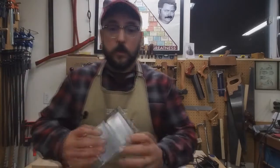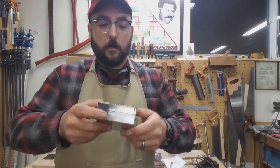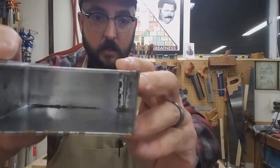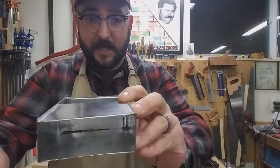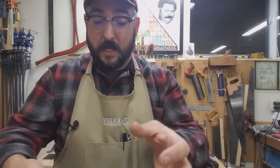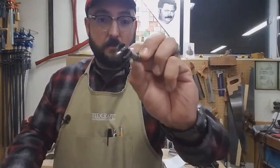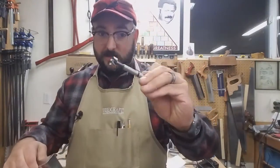One of the important things to do is when you go shopping for tins, if you don't already have some and you're going to convert them, you want to make sure that the outer piece is as flush to the top as possible in order to get that inch and a quarter. Now, if it's not a perfect inch and a quarter, that's fine — you could work those tolerances within a few thousandths, but you're kind of pushing it.